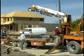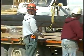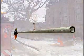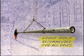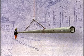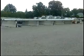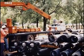While spun concrete poles are tough and durable in service, they should be handled with some care. Although shorter poles may be unloaded using a single pickup at the point of balance, for safety reasons a two-point pickup is recommended for all poles, and specifically required for poles over 50 feet in length, with the two points positioned approximately 20% of the pole length apart. When stored, poles should be supported so that they do not bend under their own weight.